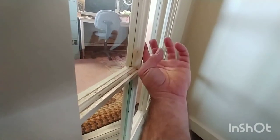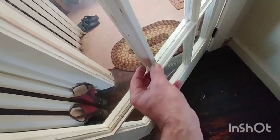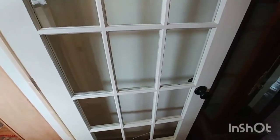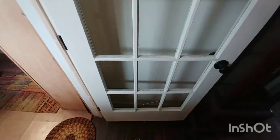And I could back it up for the first installation with a chunk of steel, but on the second installation, I really haven't got a nice big surface to put a chunk of steel against to back up the blow from the hammer. It's all very upsetting to the glass. I don't think this broke trying to do one of those things, but long story short, I opted for shooting in staples because it's pow, pow, pow, quick and essentially not a lot of trauma to the rest of the assembly. So I pulled all of the tacks out and just shot crown staples.